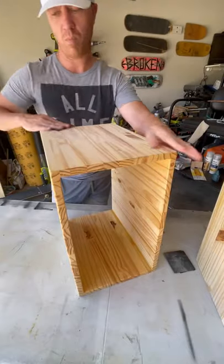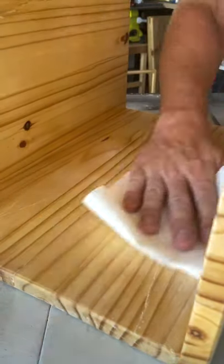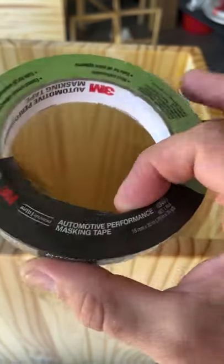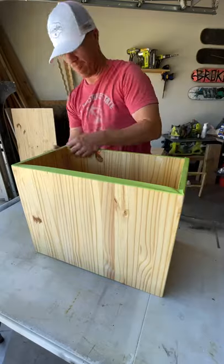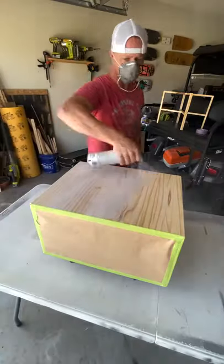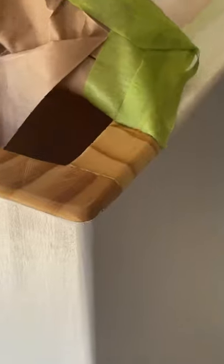Occasionally when poly soaks into the wood it can raise the fiber, so I went back with 800 grit to sand it down smooth, then used a lint-free cloth to pick up the dust before applying my final coats. My secret weapon is automotive paint tape. Unlike traditional masking tape, automotive tape is designed to be curved and bent to make any kind of line you want and hold that line for a sharp result. All that was left was to apply several coats of paint, let that dry, and peel away the tape, revealing that perfect edge.